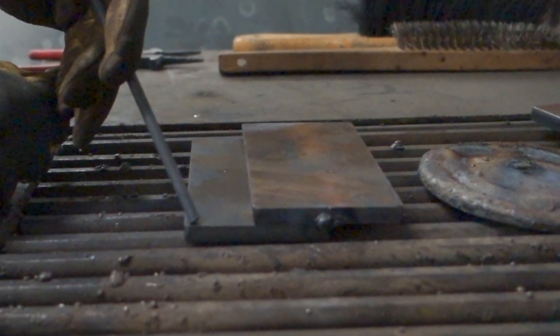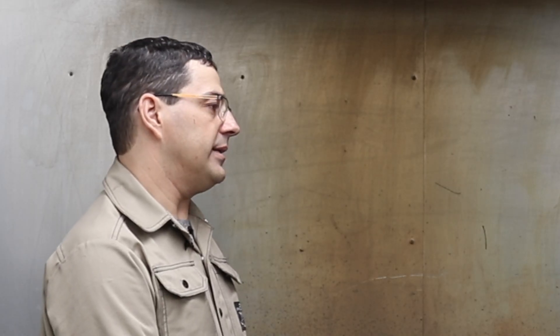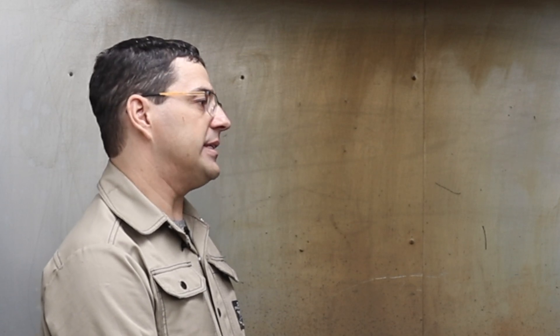What kind of steel are we going to work on this morning? Today we'll be applying this to some carbon steel, and we're going to run it flat. The hardness as deposited is 200 Brinell, and it work hardens up to 450, so it does get quite hard.